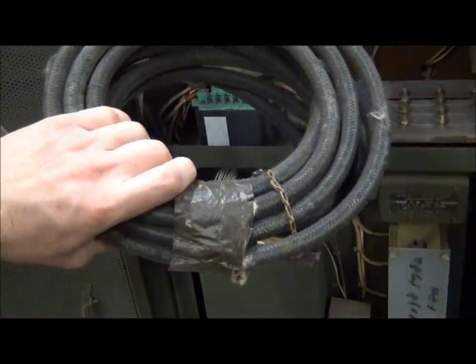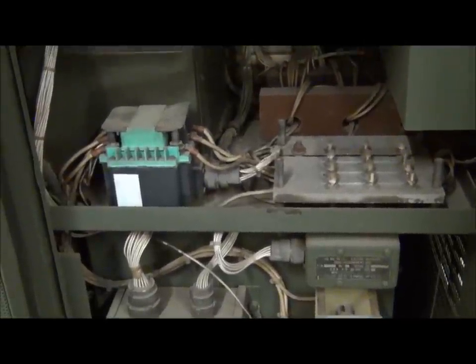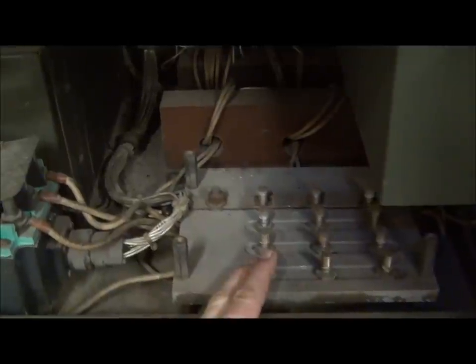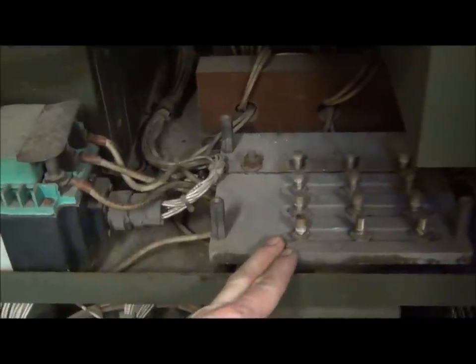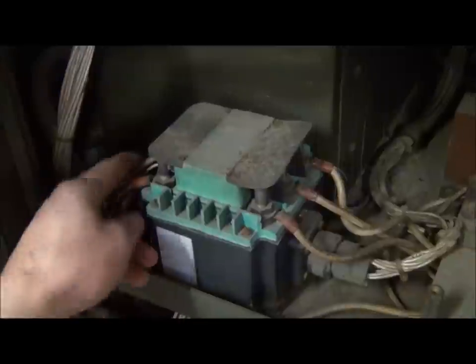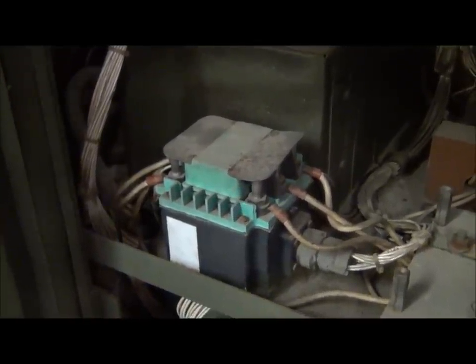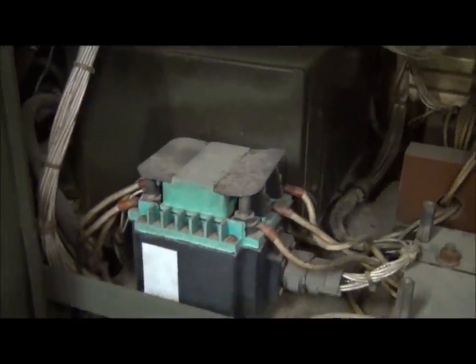Looking inside the generator housing, we've got a fuel hose for auxiliary fuel tanks when you're not running from the onboard tank — that would be useful. Taking a quick look at all the wiring, I notice right away that our voltage reconnection board is missing. I have a spare one, but it concerns me when something like that is missing because it probably means someone was taking it apart. We've also got some loose wires on our main circuit breaker — someone may have loosened those intending to take the breaker out. I'll need to tighten those down and may be replacing that breaker. All the amphenol connectors are tight and I don't see any damage to the wiring.